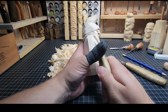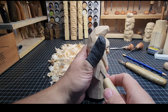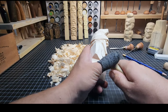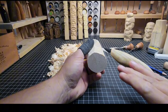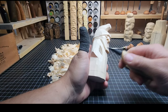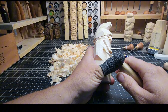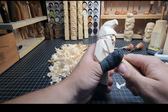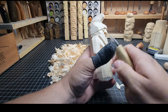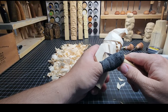Using this detail knife, I'm going in pretty deep at a 45-degree angle — not straight from the side — defining that inside of the elbow. Do the same thing on the other side but not at such a deep angle, so that I bring that arm down to the pocket. Cut in, pop that out — that provides a little depth. Make it a little deeper, then stop cut where you need to to bring those chips out and put a little depth on the inside of that arm.